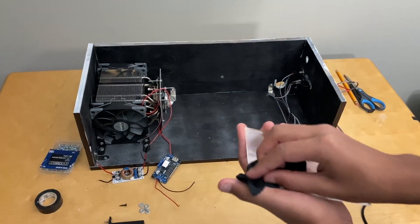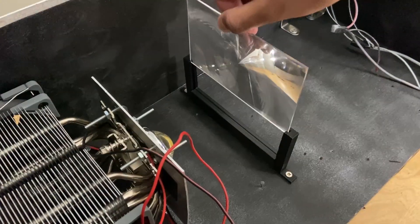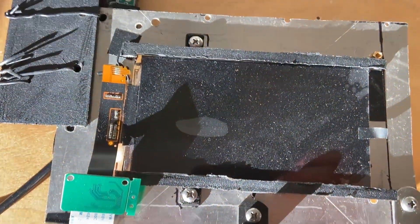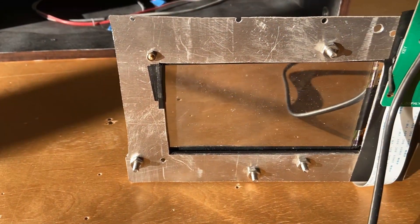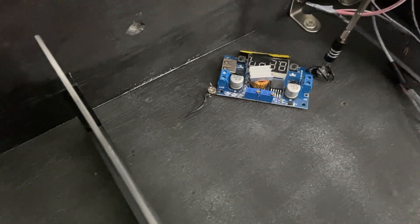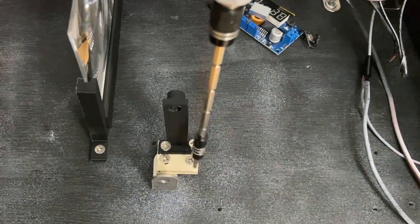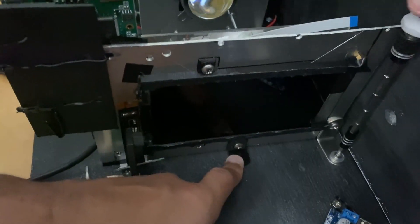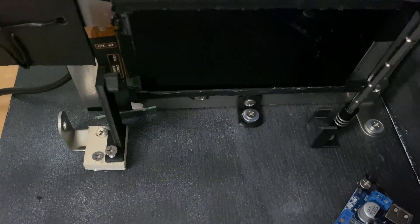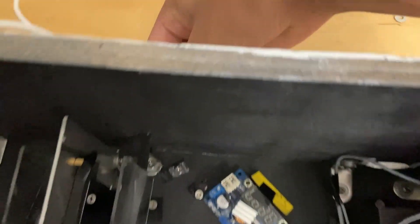Then we can move on to Fresnel Lens 1, which I'll give a quick cleaning with lens cleaning solution and a microfiber cloth — I'm going to do this with all the lenses in the build, just to make sure it's as clean as possible starting out. We can get the LCD and its accompanying components ready. I've integrated it onto one aluminum plate for simplicity. I mounted the 5V voltage step-down for the LCD, then screwed down the bracket for the second Fresnel Lens, and mounted the LCD layer. Next is a 3D printed support to prop up the Fresnel Lens. The end of this Fresnel will be attached to a 3D printed knob inserted from the outside through a hole — turning it will rotate the lens, therefore achieving keystone correction.